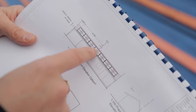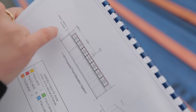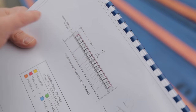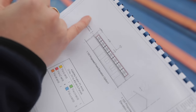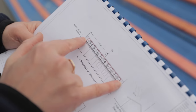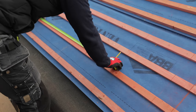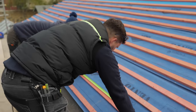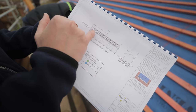We've got the center line here and we're double-checking that it's correct with the actual building. The 890mm measurement gives our spacing off the end for the first panel, so everything should be laid out equally with an equal space either side - it's 20 centimeters off basically. On this drawing, 6120 is the measurement from the end of the panel to the center of the array, based on the size of the panels and the gaps in between.